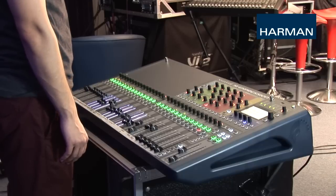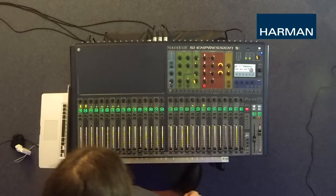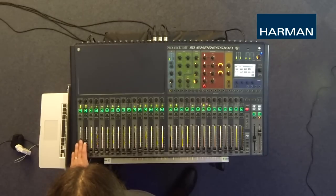I'm going to start with the drummer's wedge as it's plugged into output one of my console. Now if I press this mix one key the faders flip to the bottom of their travel. Fader glow is lighting yellow, and if I listen to my headphones they are now silent. This is because Totem solos that mix bus so you can hear what you're mixing to it. I'm now within my drummer's mix and the fader levels are now adjusting how much signal is sent to that monitor wedge.